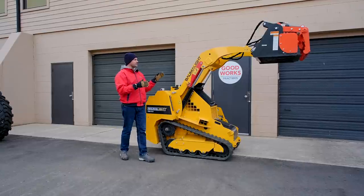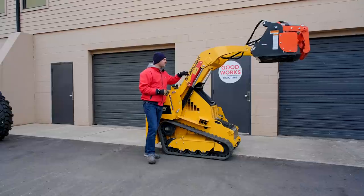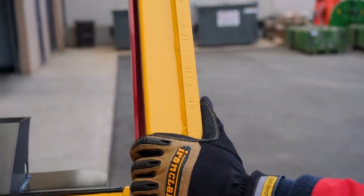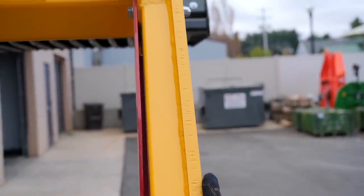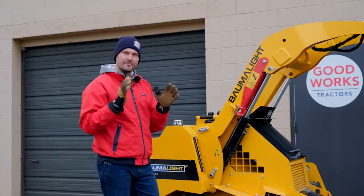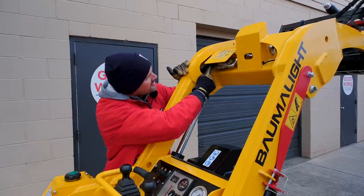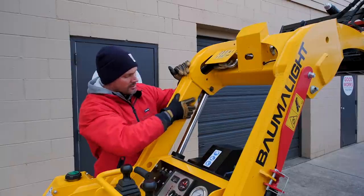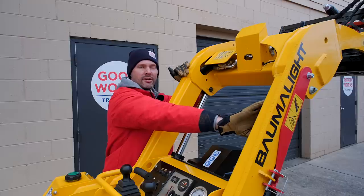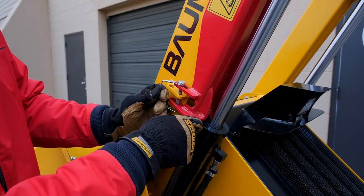There are a handful of other features that really stood out to me. Number one is the three-quarter inch thick plate all along the boom arm here - that's a pretty incredible feature. It is just very, very robust, and you have reinforced channel along the backside as well. It shows this is built for rugged applications. The additional auxiliary hydraulics are very well hidden and protected inside the channel. You're also going to have the safety brace here, so if you need to service it and have maintenance, you can lock it out so you don't have to worry about anything falling down.